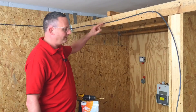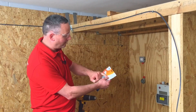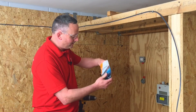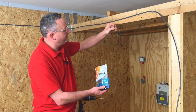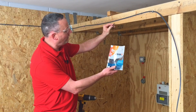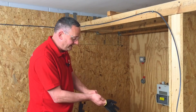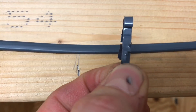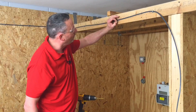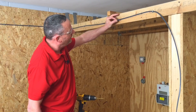We're going to fix one into the wooden joist. Opening up the pack of Linian fire clips — these are designed for one millimetre squared twin and earth cable. The clip is a metallic fixing that doesn't require wall plugs on brick or block surfaces. It's fully sprung open, and you squeeze it into the drilled hole — the force of it reopening holds it in place. It also has little barbs on the legs to grip the surface as it's inserted. Be careful — they're very sharp.